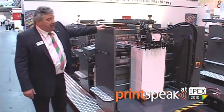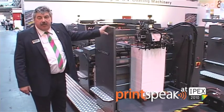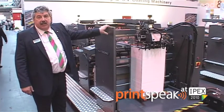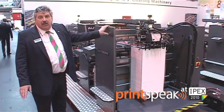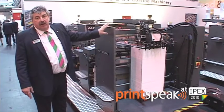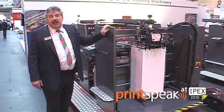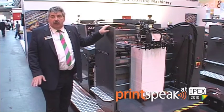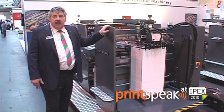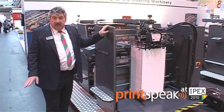This particular machine I want to introduce you to is a 105 B1 Landscape Film Laminator TTHS. It's a thermal one-sided laminator. It also has a perfecter on it with a Heidelberg feeder and a stacker. The high-speed film laminator runs up to 80 meters a minute, either one or two sides in one path. We're going to show you it running at 15,000 sheets per hour this morning.